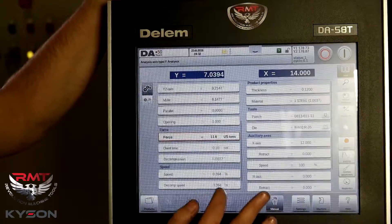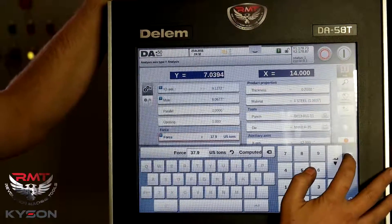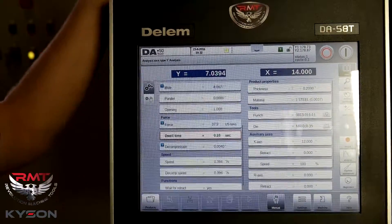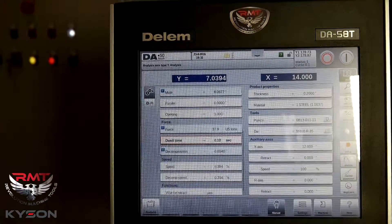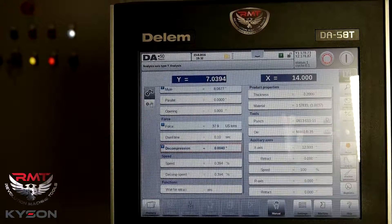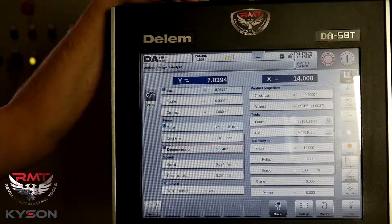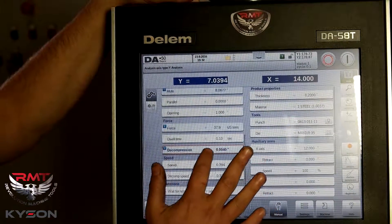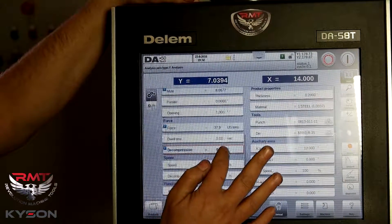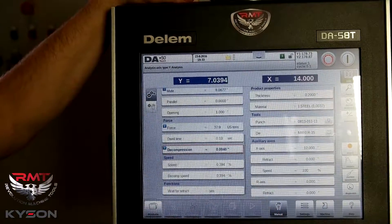Force: 11 tons — it calculated automatically for this material. Let's say I change the thickness to 0.2 — see, it automatically recalculated our tonnage because I've got it set on automatic calculation. Dwell time at the bottom of the bend: if for some reason I need a dwell at the bottom, I can program it here. Decompression is the reverse of bend. My analogy with decompression is sometimes you don't want to let a pair of vice grips go instantly. So you program a distance of decompression — the reverse of bend — instead of just instantly letting the pressure off and letting the ram return. Program that softly, let it off. Sometimes it's much safer to do that. Maybe you're trying to catch a crane or you've got a big part — you can program a decompression here. This is distance and this would be speed, like bending speed and decompression speed — they're just the reverse of each other.